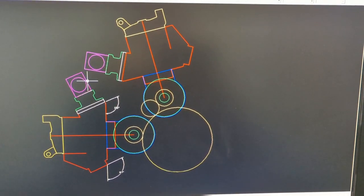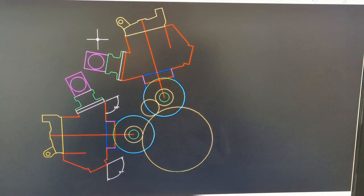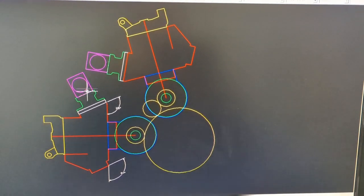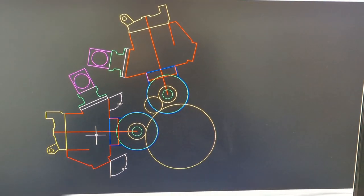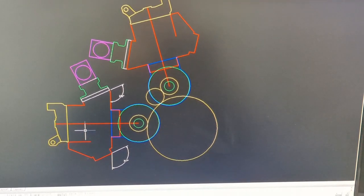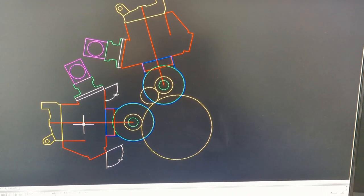I've arranged these cylinders around basically the intake, and I would make a big carbon air box around this — something like that. I wanted the lower cylinder horizontal and not much further down. You could slant the cylinder downwards, but if you get a flooding problem you can get a hydraulic issue quite easily, so I'd rather have it just horizontal and no lower than that.